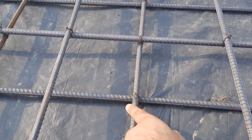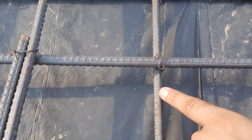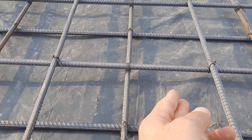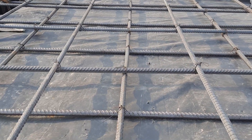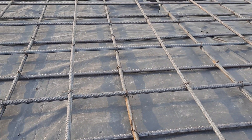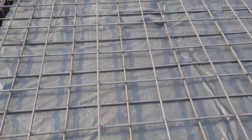This is doubly mesh, not singly mesh. You can see we have three steel rods here — one, two, and three bars. Double mesh is more important compared to single mesh. Spacing is 6 by 6 inches, or 150 by 150 mm.